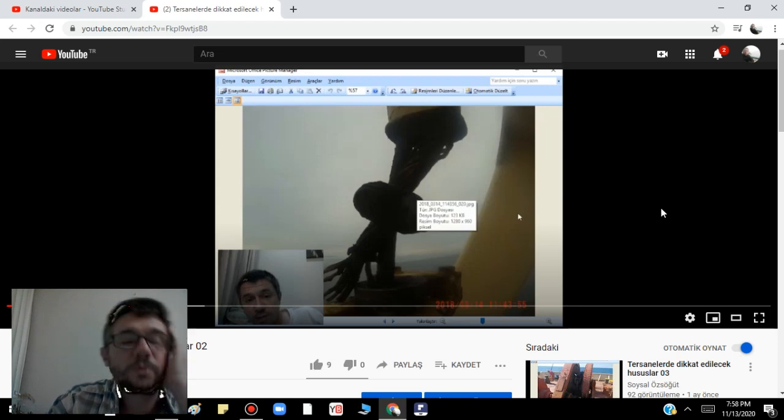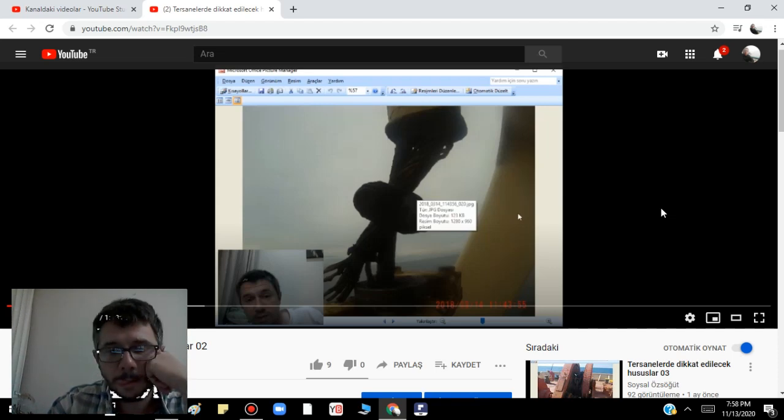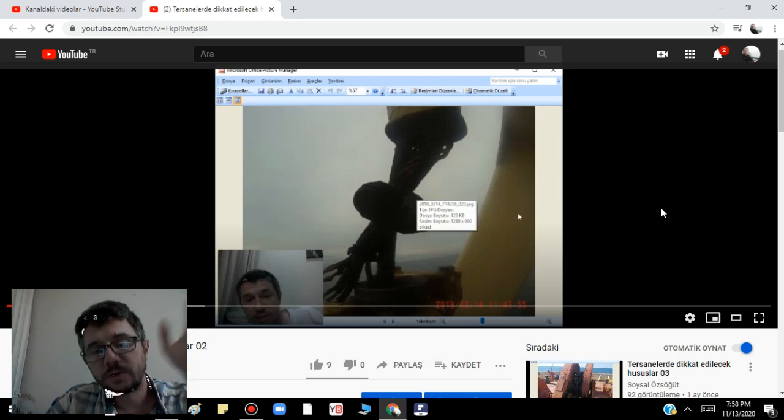You see some deformations, several things. Also the other ladder is the same. So we opened all of them. This is the free fall life pod — you see it is not good grease. It is not good grease, it is stuck up inside. And then one side going down, one side staying up — there is some problem here. Also they put some railing, the wire clip here, and this is not mechanical splicing. This is very poor condition, very poor seamanship actually.